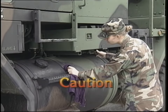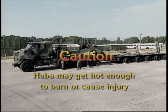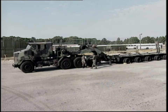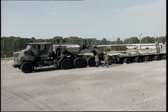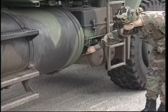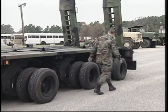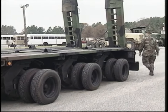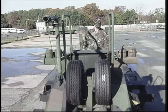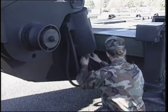Remember that fuel is very flammable and can explode easily. Then check the left side wheel hubs for warmth and obvious damage — be sure to use caution because the hubs can get hot enough to burn and cause injury. Just like you did in your before operation PMCS, check the tires for cuts, gouges, and cracks. Listen for the sound of air system leaks around the air reservoirs. Pull three cables by the battery box to discharge all moisture. Again, check the left side and rear exterior for obvious damage. Continuing around the semi-trailer, it's important to repeat some of the before PMCS and during PMCS steps, such as inspecting the steps and guard rails, checking the sediment bowl on the fuel filter assembly, and inspecting the gooseneck pivot cylinders.